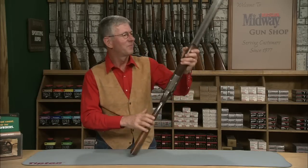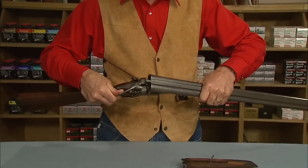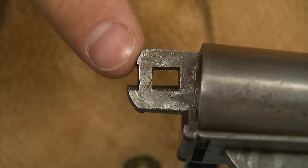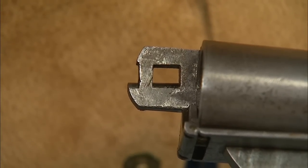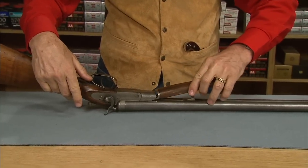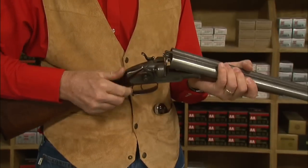Let me show you how to take this one apart. It's as simple as removing the fore end and unhooking the barrels from the receiver. There was only one locking mechanism, a rotary style bolt that hooks through this hole in the rib extension. Smiths almost never shoot loose and you can tell this gun is still tight just by the sound it makes when it closes.